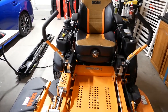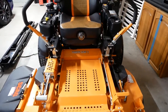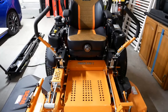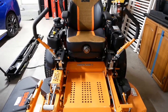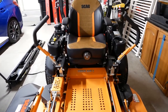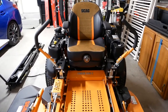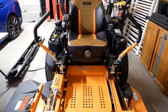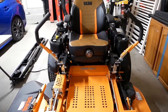One of the other big things was the clutch. This clutch is an Ogura 250 foot-pound clutch; the Patriot had a 108 foot-pound clutch. Bigger isn't necessarily better — this is a different style of mower — but I did like it. Both clutches have an adjustable air gap, so as the clutch wears you can bring it back within spec without needing to replace it earlier. That's a nice feature.